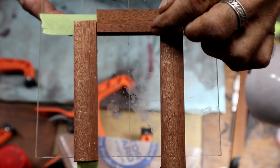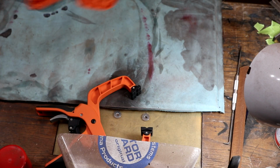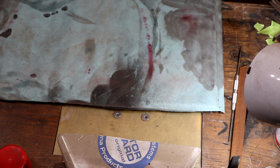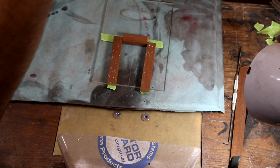It falls away a little bit differently than what the router bit radius is going to do for us. So I'll put a little bit smaller radius router bit in the router than I need. That way I can ride that corner around and not have an issue of having to change router bits halfway through, because the router bit I got in there is too big. Anyway, we'll take this over to the bandsaw, get this cut out, and we'll cut this finished shape out on the router table.